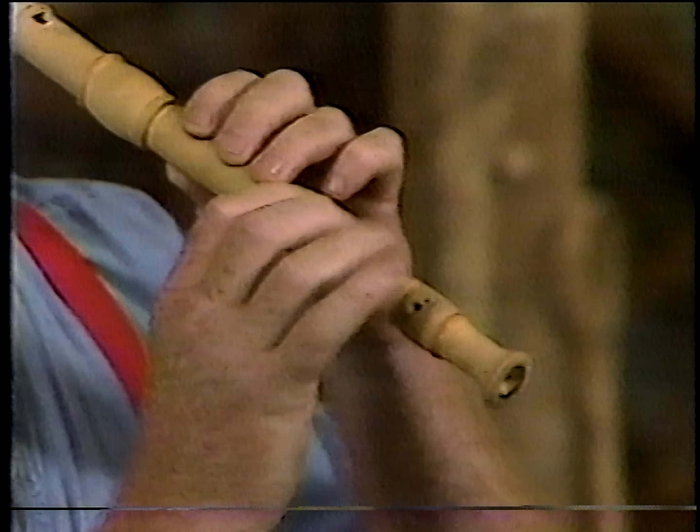Here I'll show you all the tricks we have to go through. We've got to bore a socket hole down here to take the foot, and then we've got to bore the fipple bore, which is a little smaller. I've got a piece here that I've already started boring. I'll put it in the vise and finish up boring the bottom hole. This is not the kind of auger that would have been used in 1600 when recorders became popular in England — this is a regular Jennings bit, a little spiral auger. You can bore through the grain all the way down from one end to the other using these spiral augers.